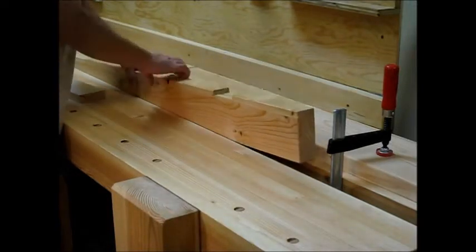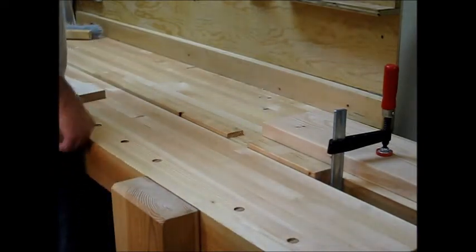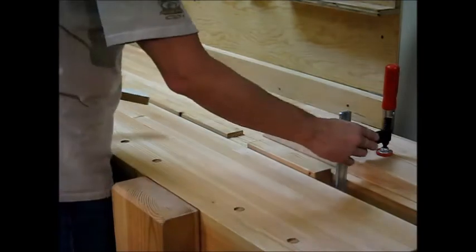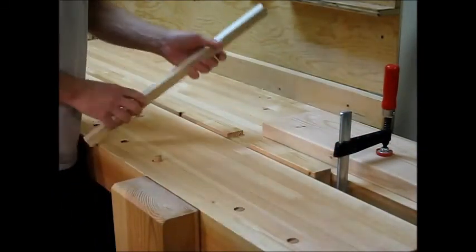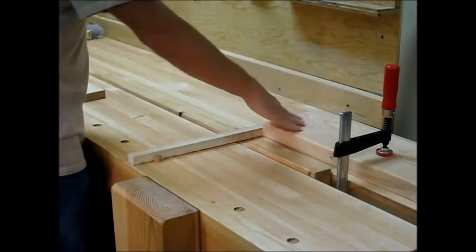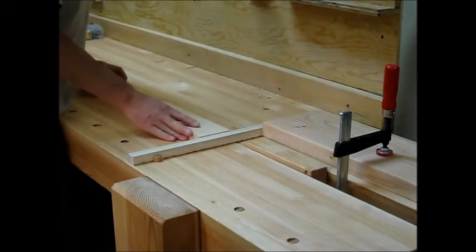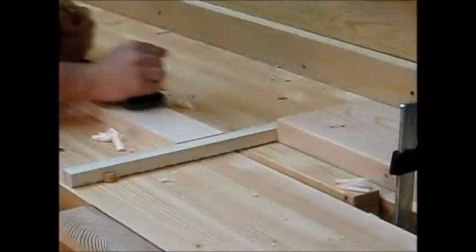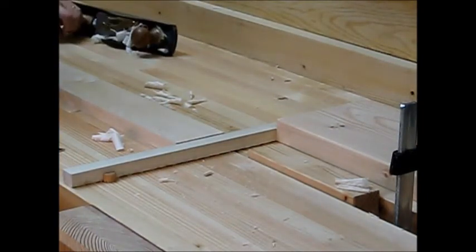What I'm doing here is flipping over my gap stop and setting up a corner so that I can do some planing without having to clamp a piece in. Clamp the piece on the back slab even with this dog right here. I put a piece from that piece over to the dog across that notch in the gap. I simply use those two stops as planing stops — makes it a really quick way to be able to flatten a piece of wood.